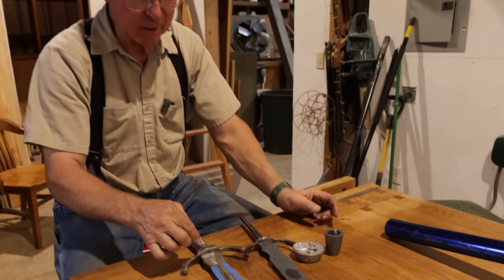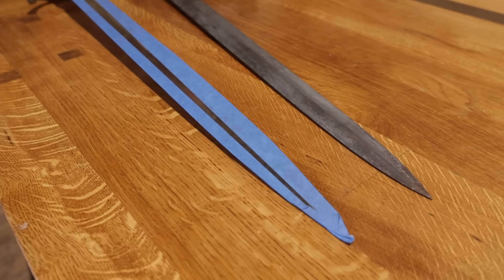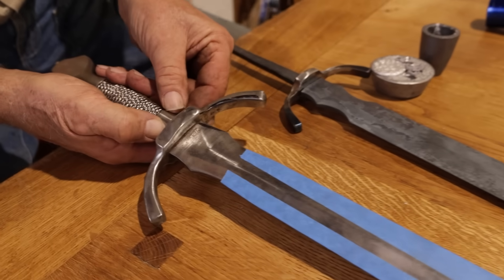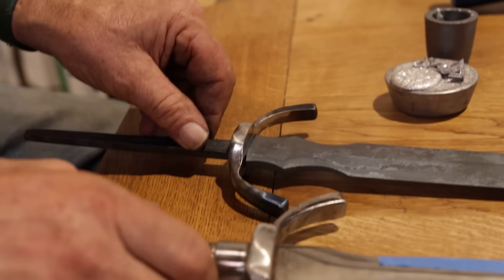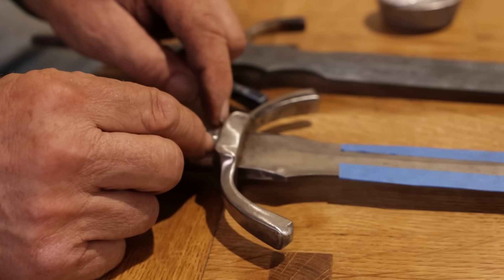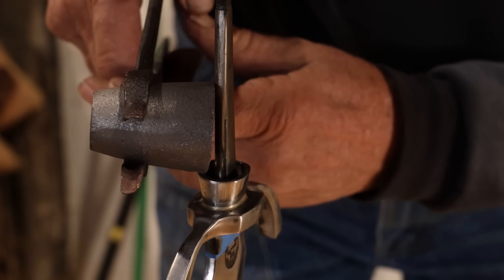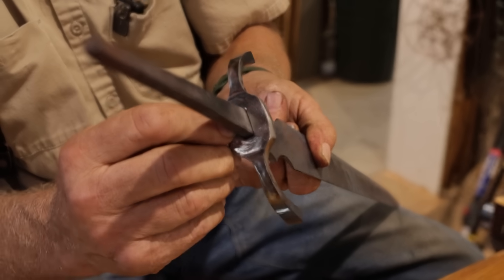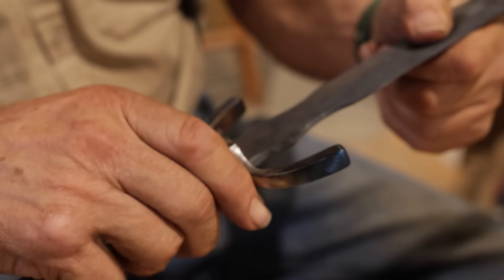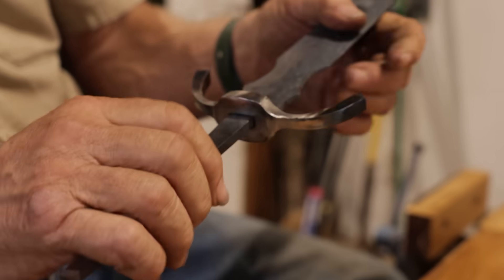The last one, frankly the most satisfying, is I use it on my swords. For instance, this sword is for Holly, this one was my wife's — I'm getting scabbards made for both. Right here inside this little ferrule, this socket which attaches to the hilt — the hilt is just friction-fit on there. When the hilt has this socket soldered to it, there's a void — I pour that little void full of eutectic metal and you get a 100 percent tight, metal-to-metal embedment all the way around.